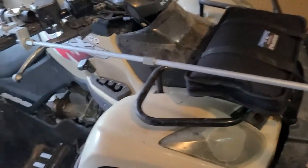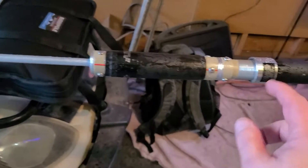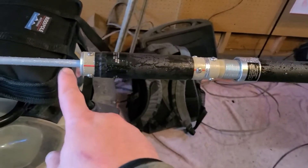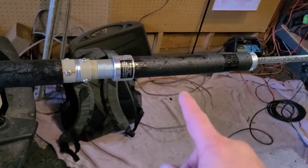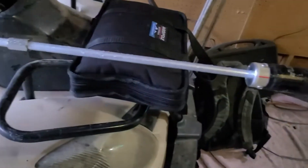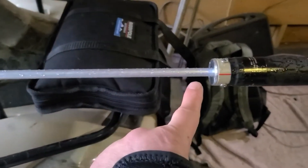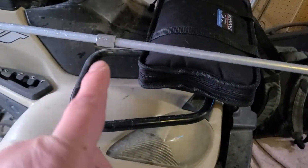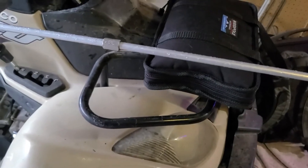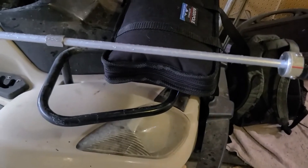You can make this thing pretty short — stick it in a go bag and it makes a great portable antenna. Now to do anything but 80 meters, you simply pull this bottom resonator out and screw the bottom mast into the bottom of the super slider. Then you're good for 40 through 10 meters with just the super slider. The instructions then say that you take both the super slider and the upper portion of the bottom mast off, and screw your telescopic whip into the coupling nut here. This antenna is then adjustable by just the telescopic whip for 6, 4, and 2 meters.